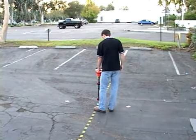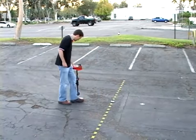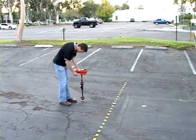We've used the equator to help guide us to the sonde and localize it, and from here we can finish our locate by marking the poles and equator and verifying the signal strength, just as we did before.